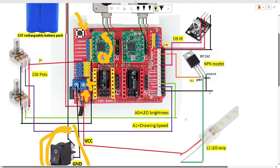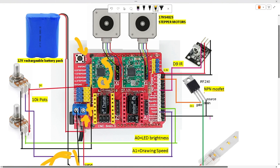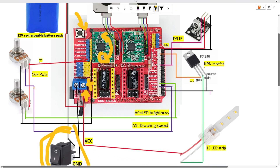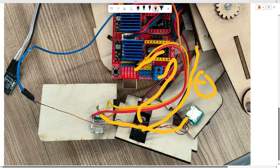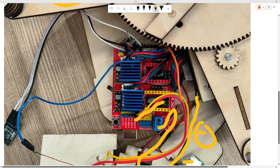Next, we can solder our potentiometer. I have 10K pots and we can take five volts — I'm using this pin right here on the CNC board and will solder a wire between our two potentiometers. The two outer pins will have negative and positive respectively, so you want to solder wire between those. You'll feed the positive five volts on one side and the other side will be connected to ground. The center taps will be used to connect to A0 and A1 on the board.